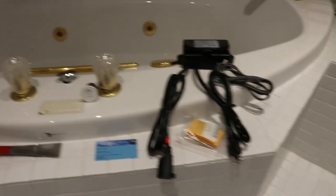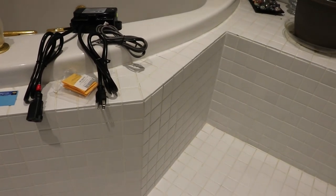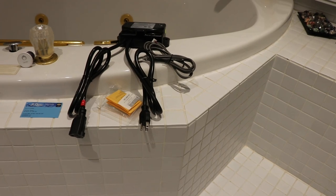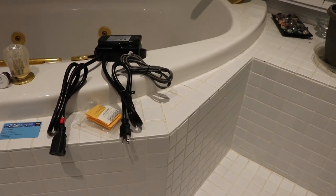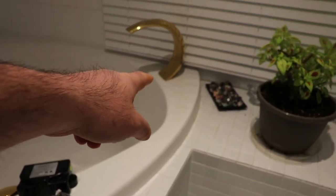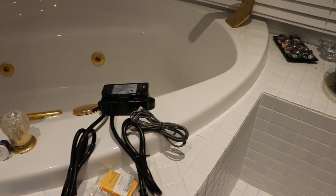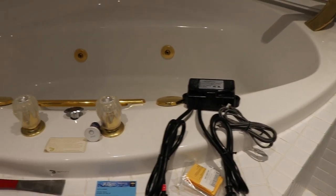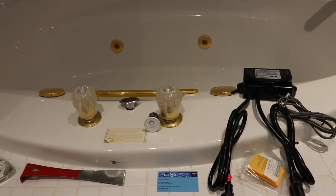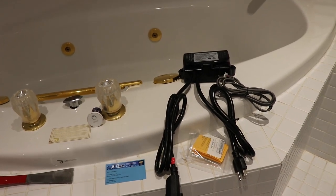In that case, like with this tub, there's no immediate access in the bathroom but thankfully we're over a garage and there's an access port to get up to the motor. I'm not sure where the motor is exactly - this might be right here or it might be underneath the faucet - but we'll take a look under there. I tested the controller and it didn't work. I tested the motor and was able to make it run, so I proved to myself that the motor is good.